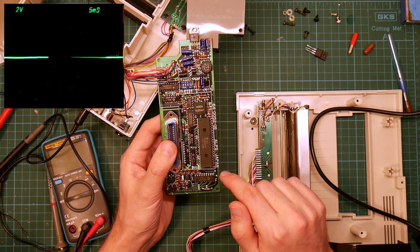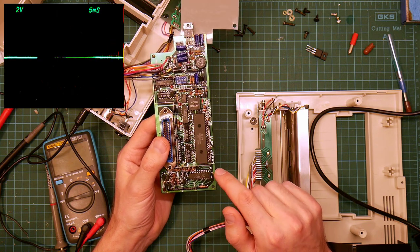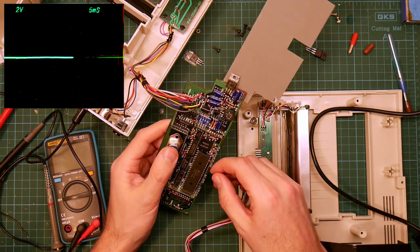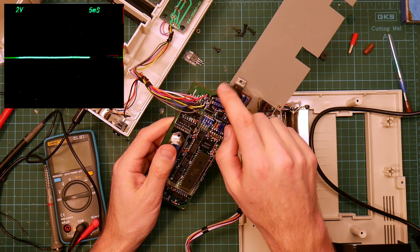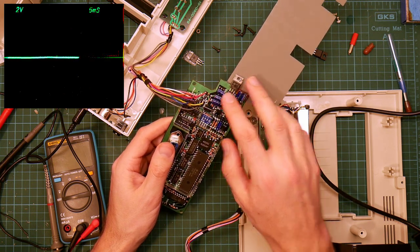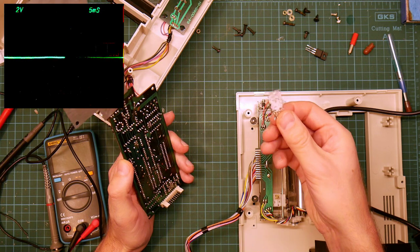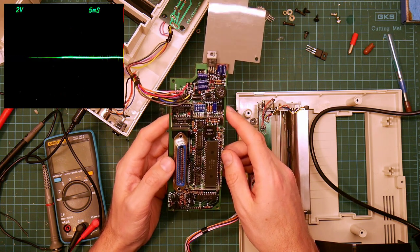We could try replacing the driver chip. I can get a replacement for about three to four francs plus shipping — it's just a matter of removing the old one, sticking in a socket and plugging it in. That's probably worth doing. If I'm going to do that, I might as well get a couple of modern switching regulators and replace these. The advantage of switching regulators is they produce far less heat, so I wouldn't need the massive heat sink anymore, and there'd be much less stress on the board. Plus less worry about the thing overheating if I don't get the thermal paste right.